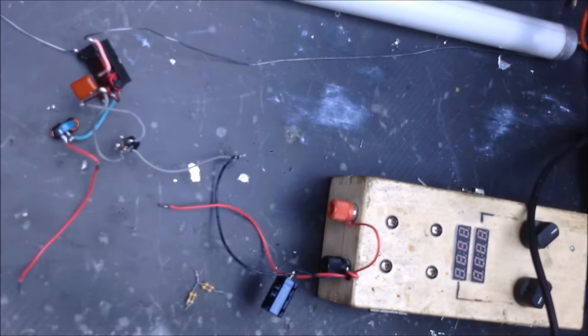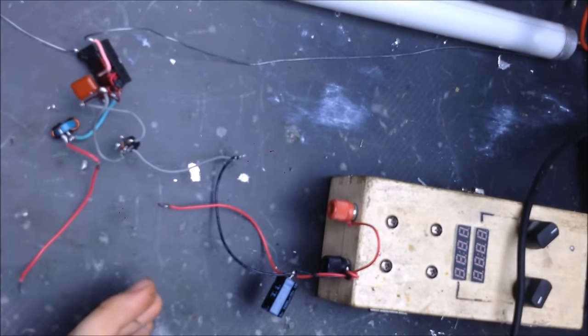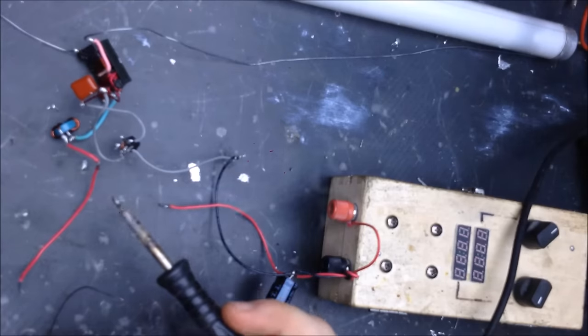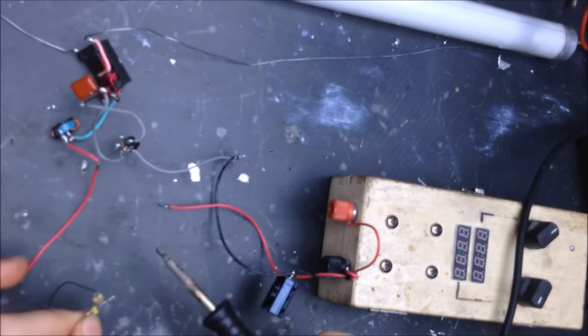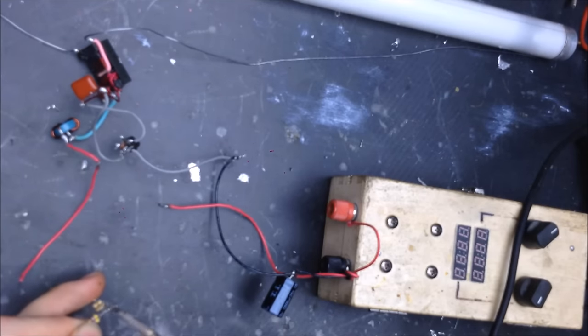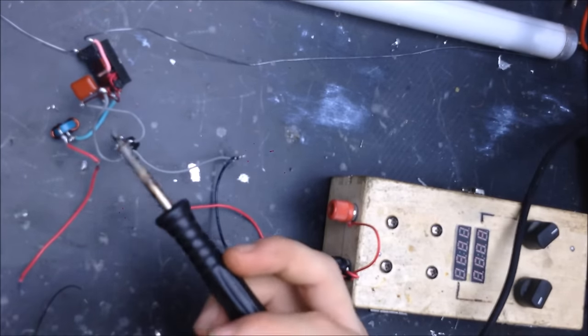If you are increasing voltage in your circuit, so for example, if you're using a 20 or 30 volt circuit, you probably want to shoot for 1 kilo ohm to 2 kilo ohms. If you're using a lower voltage circuit, you're going to be relying more so on the current to switch those MOSFETs on more than the voltage.